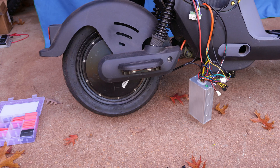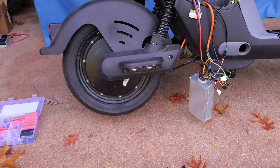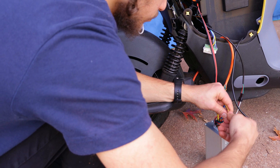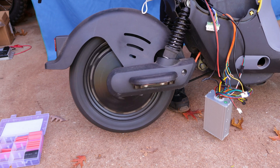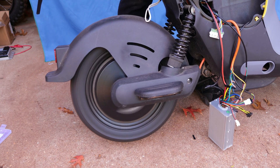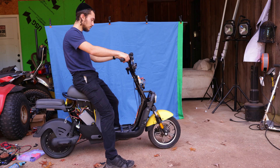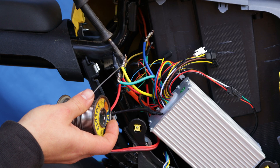But the question is, does the motor spin? Well, it's definitely trying. So to fix this, I'll once again play around with the wires until I get it right. It does work now, but it's going backwards. There we go — once I swap the phase wires again, it's spinning in the correct direction. Now that it works, I'll solder all the connections and then wrap them in shrink tubing.